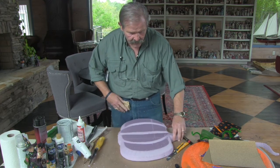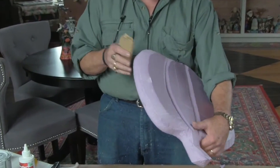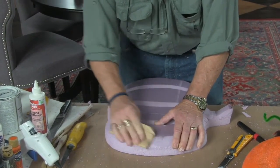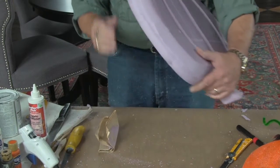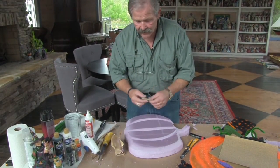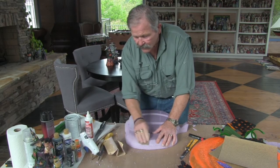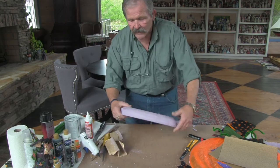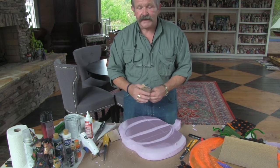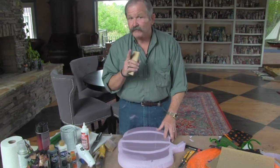I've got a couple of pieces folded up to make them more manageable, and I'll show you how easy this works. We've got this chamfer that we've cut here, and we want to smooth this down so it makes a nice round — and that's very quick. Now just that one piece, you can see how nice and round that is. If we want to make that a little smoother, we go to the finer grit and go over it. It takes out all those dimples and rough spots and gives a pretty nice finish. We'll go over this entire thing very quickly — it'll only take just a few minutes.